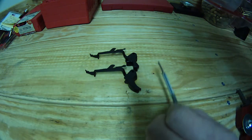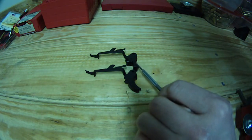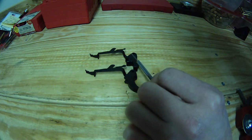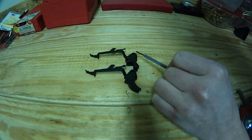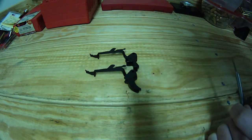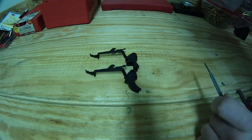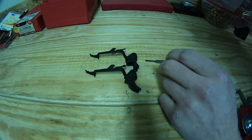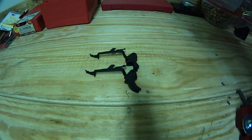You can kind of see here what they've done is they've mounted the new flat face trigger slightly forward more on the trigger bar itself, and they have this hole right here which actually runs through the middle of your ambidextrous slide stop, which is also sitting slightly farther forward. So that's how you accomplish the shorter uptake with the trigger actually being more forward.